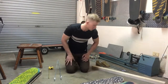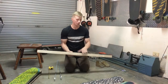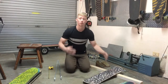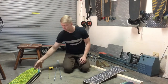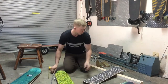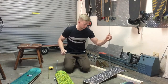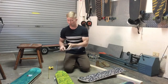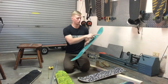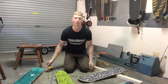Alright, to get started, I'm going to work on my base and then build up from there. We're going to cut this piece of timber in half. This is going to be my base, and I'm going to drill these two decks. We're going to have two wide at the bottom, and we're going to stack them up one by one through this threaded rod. So start with the base, drill these in, fasten the threaded rod through into the timber, pilot hole, drill hole, whatever. Then we have to mark out evenly where I'm going to put my drill holes through the decks to pass the threaded rod through. So we'll get started with that.